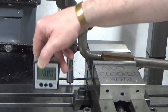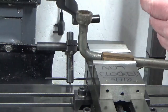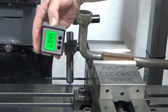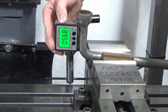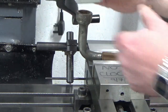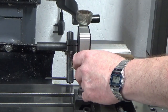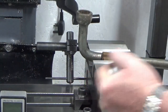digital inclinometer. So what we're going to do is just turn that on, drop it on the table, zero out. Would help if you're pressing the right button. There we go. So that's us on zero. And now I'm just going to sit that on this upright and see what we measure. So that's 89.5 degrees, roughly. I'm not going to mess around with that for what this is. I'm just going to check it the other way. Zero out. You won't be able to see the reading. 90 degrees dead on that way. So for what this is, that is perfectly good enough. So we'll tighten the vise up at that.